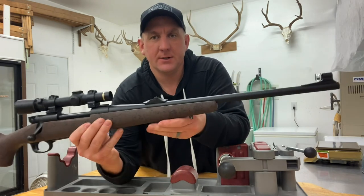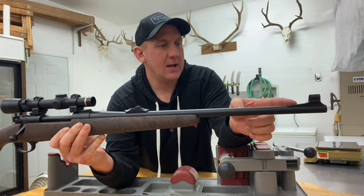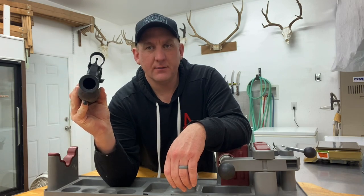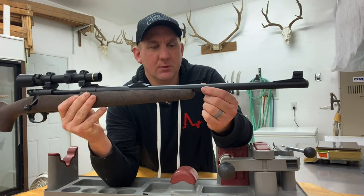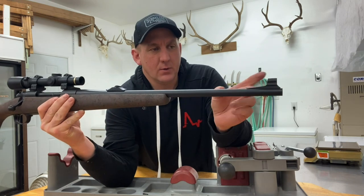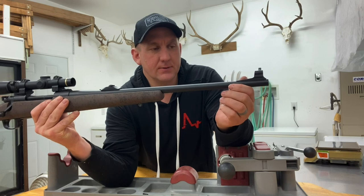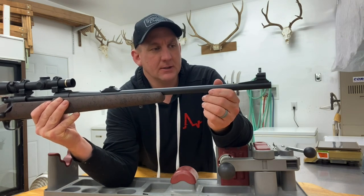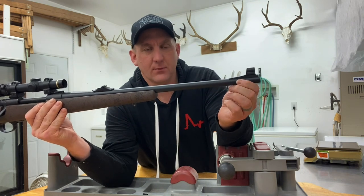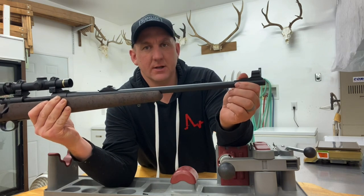The sights are a bit of a hodgepodge — the sight base is off a Ruger and the front sight is off a Winchester Model 70. The 411 bore takes up a lot of barrel, and this is a number-four contour, which is about as light as anybody will cut them. That's one reason I went with Pacnor; Shilen and Krieger typically won't go smaller than a number five. Going this small put us right on the edge for installing the front sight. My smith was very nervous, but worst case I'd have a 20-inch barrel rather than 21, which I could live with. It turned out solid.